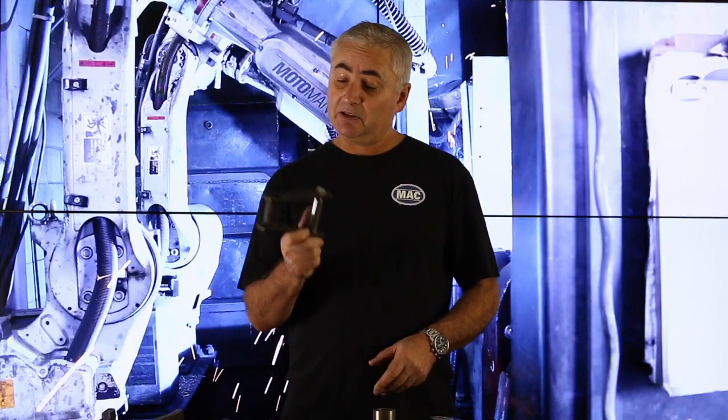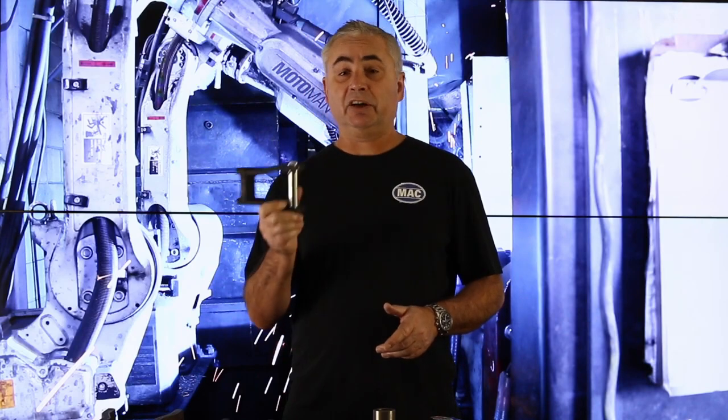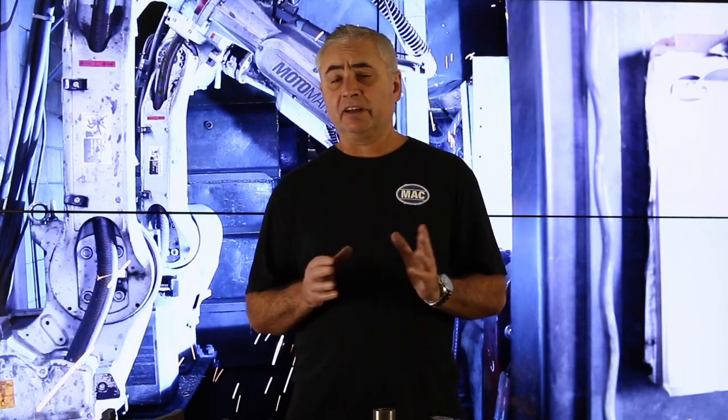Identifying welded steel mill chain or drag chain can be challenging, and that is because manufacturers in North America don't always put the stamp on the sidebar. And there's a reason for that, which I'll tell you about later in the video. To identify the welded steel chain running in your conveyor, you're going to have to measure the components and compare that with the product sheet in our catalog. I'll leave a link to our mill chain spec sheet in the description below.